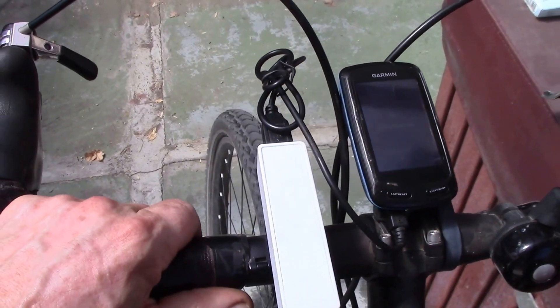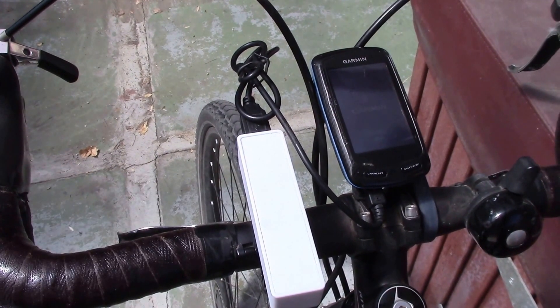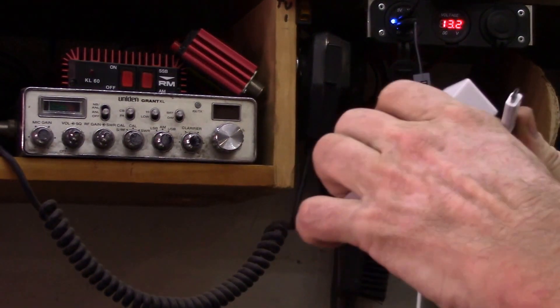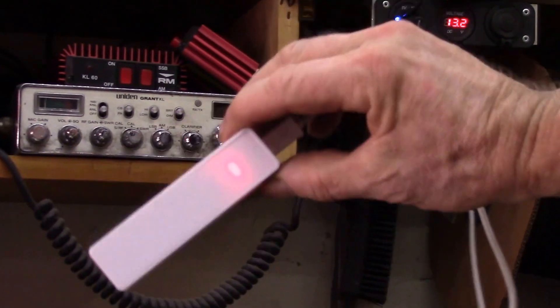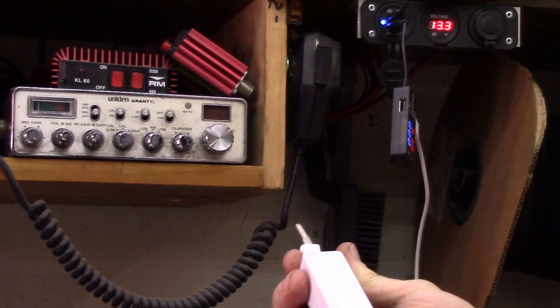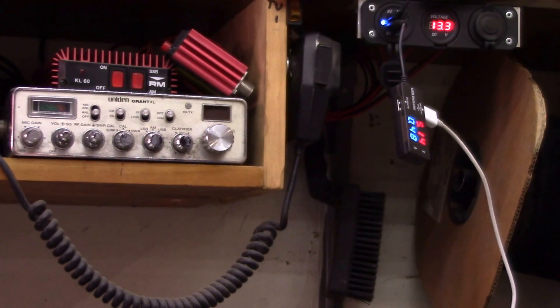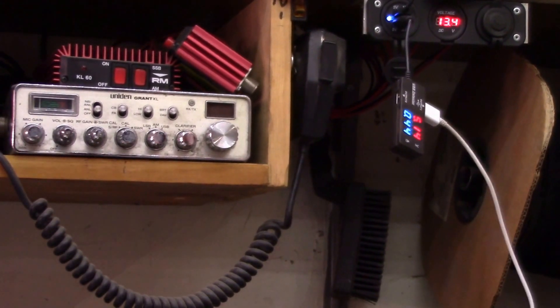It's already charged up to 53%, so it does charge. Let me plug this into one of my charger doctors and see how much charging current it draws — there was no spec on that. Okay, plugging the power bank in: it looks like this is a half-amp charger. Flashing red — that is a winner. 30-second project to make a portable bicycle power bank. I'll let that charge up; the battery hasn't been charged in a while. I think this is a 2,000 milliamp-hour cell, so it'll take about four or five hours to charge. The GPS battery is probably between 1,000 and 1,500 milliamp-hours, so I should have more than a full charge available in the power bank.